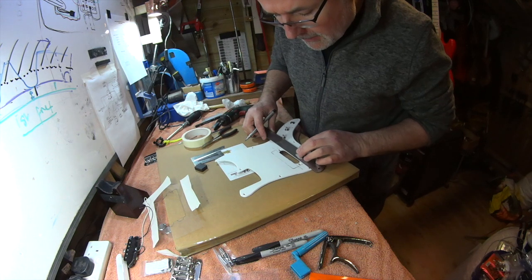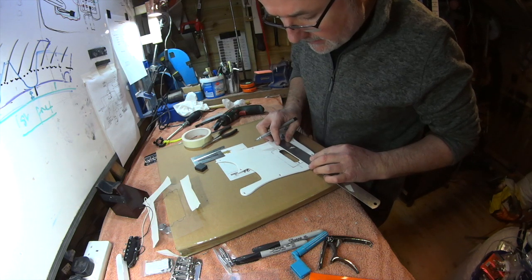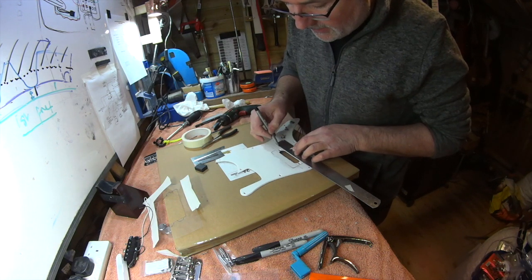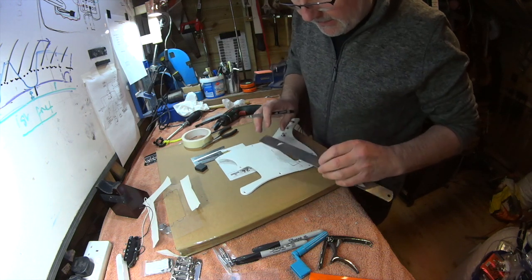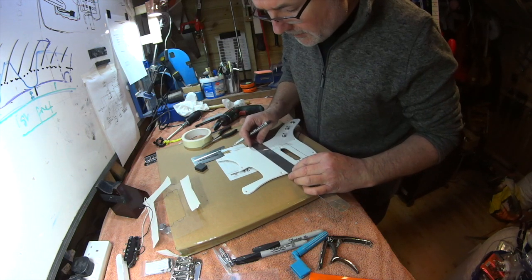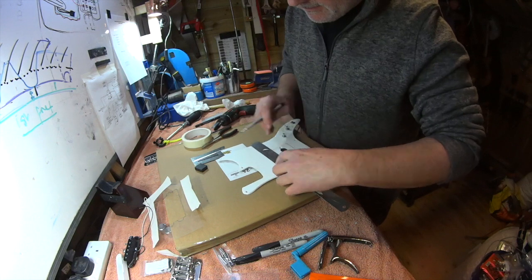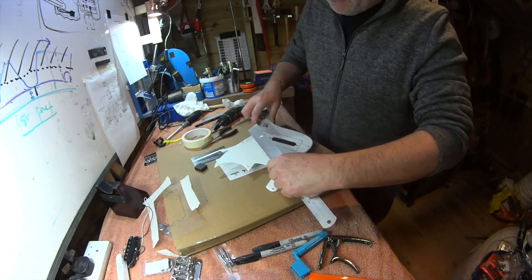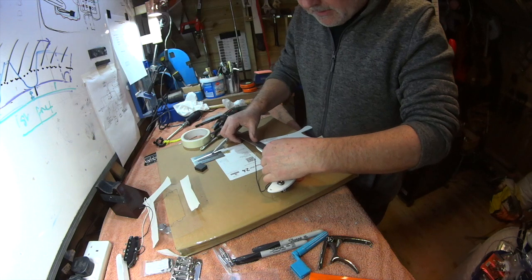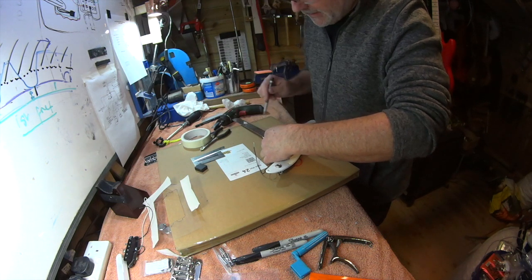Not entirely. I can't put it down straight there for a minute. So this isn't entirely equidistant, the same thickness all the way down. That's what's showing up, but it's okay. You know, pickup holes are never microscopically perfect. So on the basis of that, I'm going to look at this and go, okay, look at that one and that. So this one is just slightly under on the bottom part. That's what was catching my eye. So I'm just going to balance that out to make sure we fit the pickup nicely. Yeah, I can see the discrepancy now.